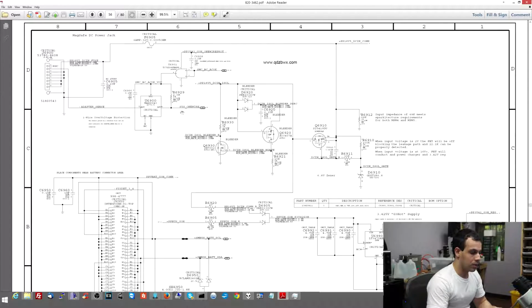Now, as I've mentioned in a million videos, you need PP3V42_G3 hot for the one-wire circuit to work. The one-wire circuit is what allows the charger to talk to the SMC, and when the charger talks to the SMC, it'll do things like turn on your green light and turn on all your power rails in your computer, but without that, you're screwed.